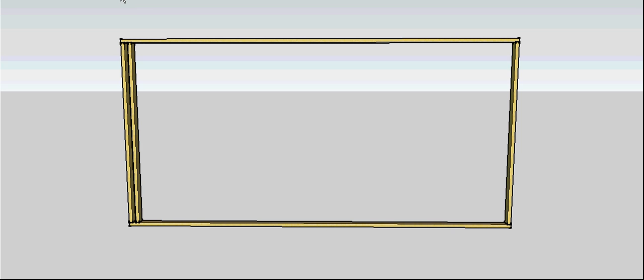There are about three or four different types of studs — the only thing that changes is the actual position of where they go. The first ones I throw in are the ones on the end, which are what we call corner studs. This set here will form the corner for the wall running at 90 degrees. This stud here will be where the two wall frames join — that may be at an intersection, or there could just be another wall continuing straight on.